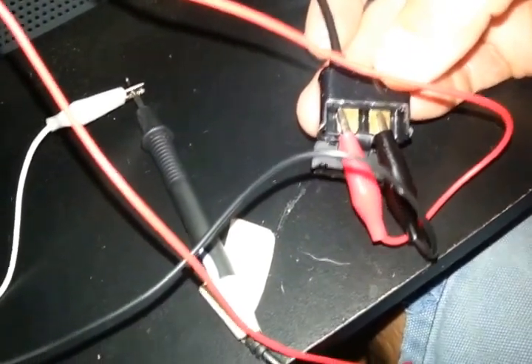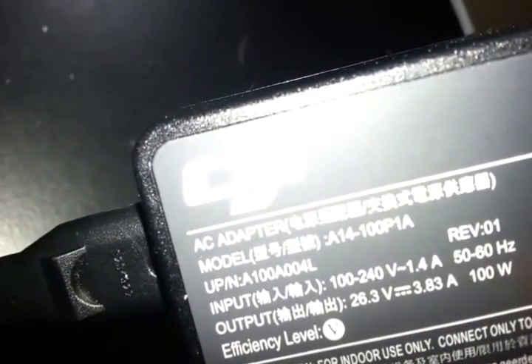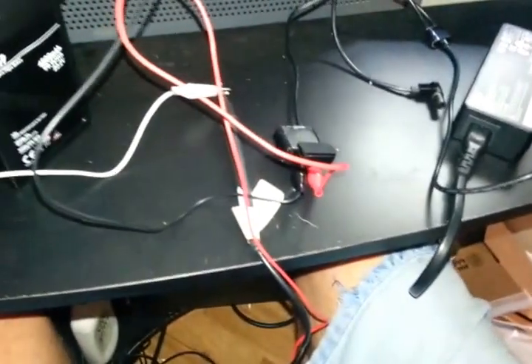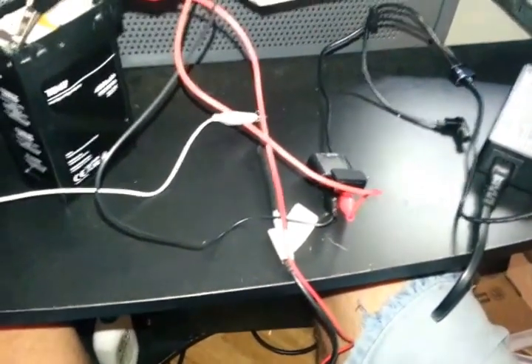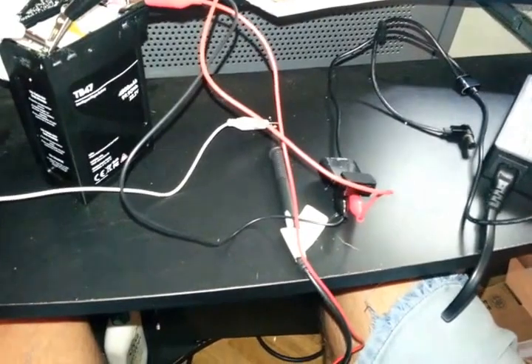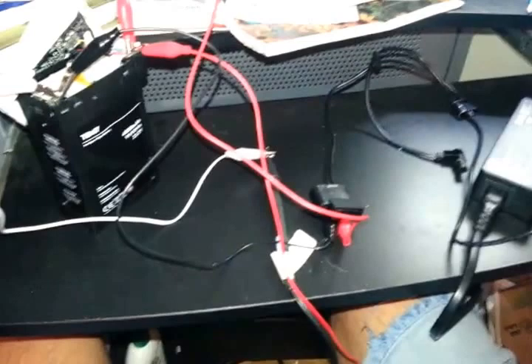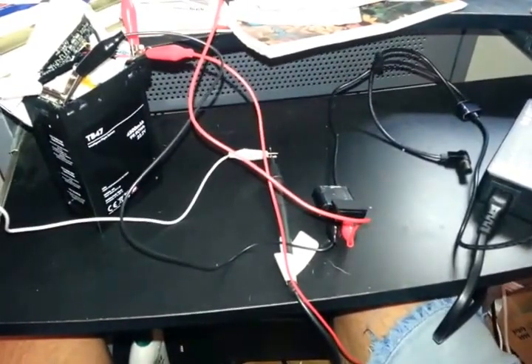You're talking an output potentially on the charger — it can be up to 26.3 volts, 3.83 amps. So that's a lot of voltage. I recommend, from my experience here, leave your charger unplugged down at the outlet. Then get all your wiring connected, and your last step would be to plug your charger in down at the cord, so any sparking is far away from the battery and far away from your fingers.